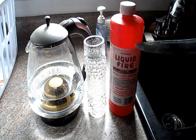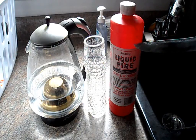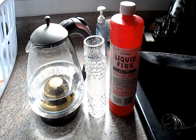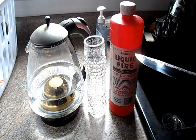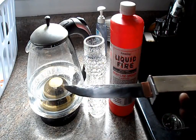Here I have a concentrated 93% sulfuric acid solution, which I water down when I mix with the hot water. This is available at pretty much any hardware store as a typical drain opener. And lastly, your knife which needs to be etched.